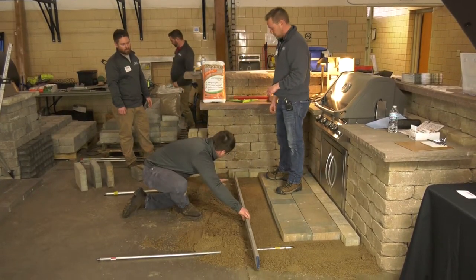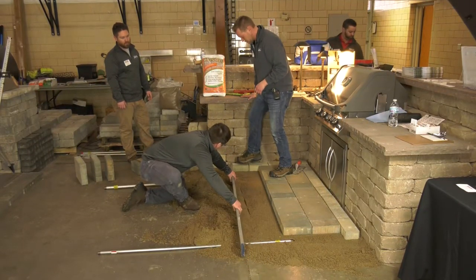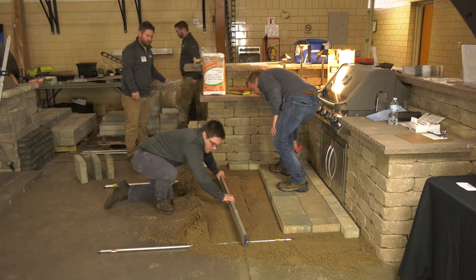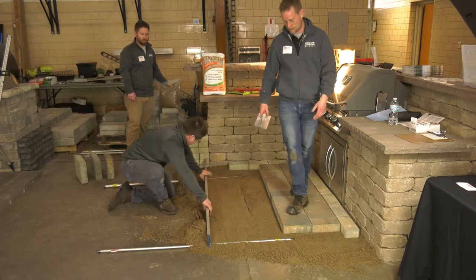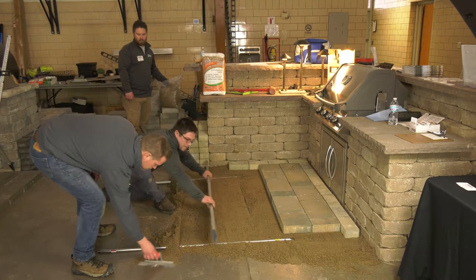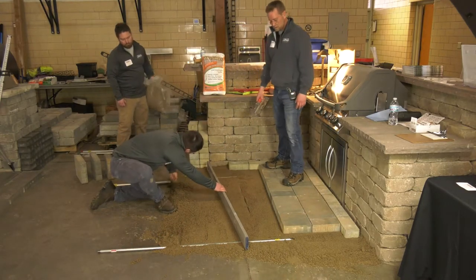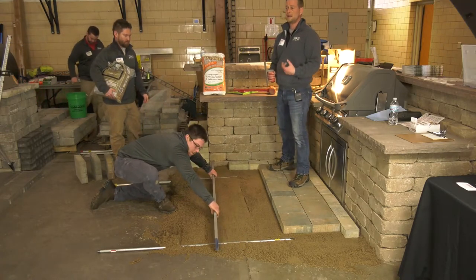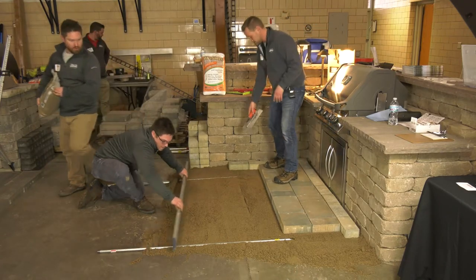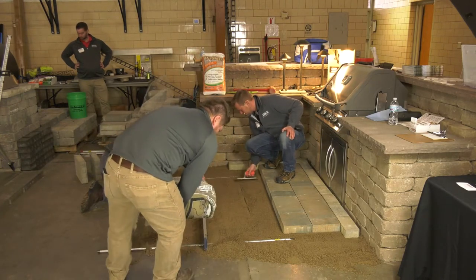All right, here we go. So we're gonna puddle this stuff up. Chris is just screening back here. There we go. And so what I'm doing here is as I see him screen back, I'm watching for any points where maybe his fingers stick in a little bit too deep, or maybe there's a situation like this where we had pulled the pipe back but not quite fixed it in place yet, and it leaves a divot.